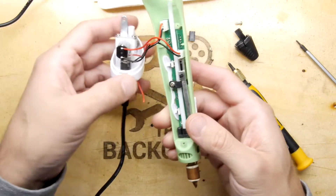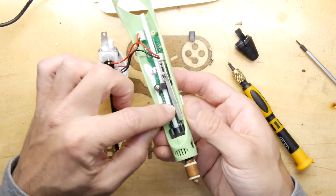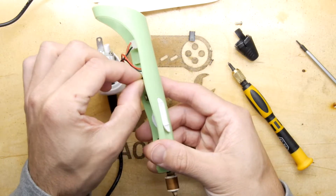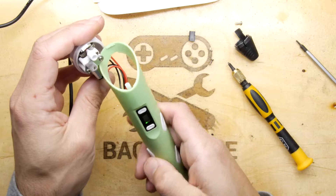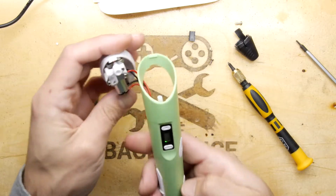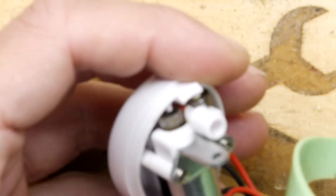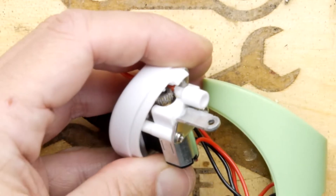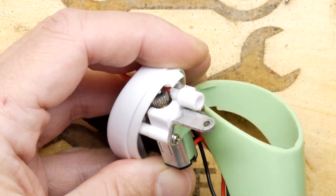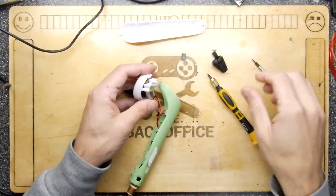Come on — not hearing the motors going. Interestingly, when you move that slider adjustment, it's being transferred all the way there to that potentiometer. Okay, here we go. When I push the extruder motor — look — the gear wheel, if it will focus on there, the gear wheel itself is not actually twisting. Motor's going, wheel's not moving.